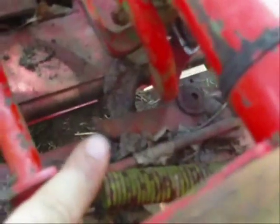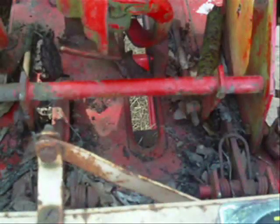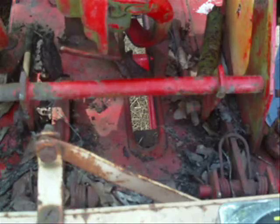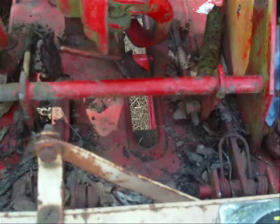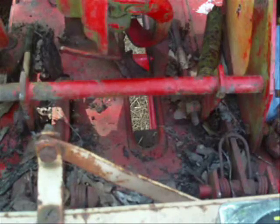There are about three pages of timing stuff in here. Next is needles to tucker fingers. That's a tucker finger right there — you've got one on each one, they're hard to see. You can see a little better from this angle. That tucker finger pushes the twine over and lets the bill hook catch it. As the needle comes in, those tucker fingers are going to move over. It should have one sixteenth inch clearance between the needles and the tucker fingers. They move behind the needles.